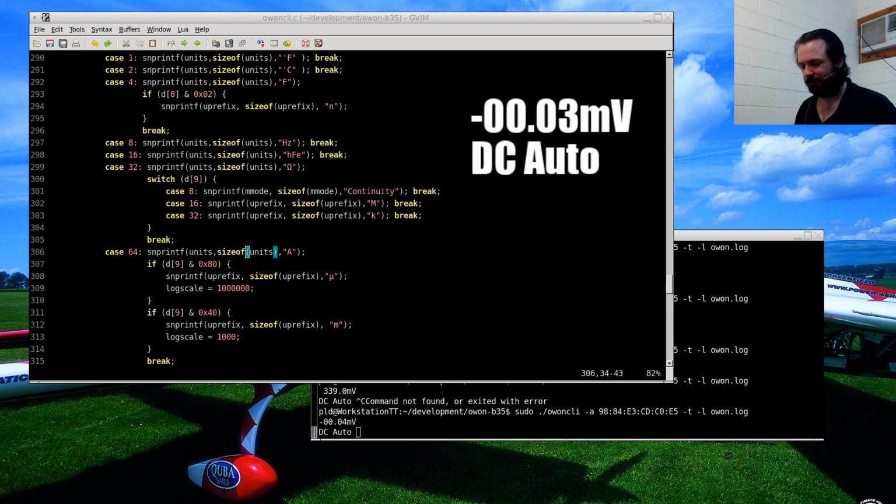Everything's working, but I have some kind of a drain on the phone where roughly every 10 to 12 hours it will drain the battery. Everything seems to work, other than the fact that when you plug in with no battery, you do not get the Apple logo. So there's a common element, I think, between it draining fast and it not coming up with just the lightning port. It's not the TriStar. I've had 4 TriStars on there, and it will charge if the battery is dead flat, to the point where it won't show the insert lightning cable logo or anything like that. When it just stays completely black, it still will boot up and charge once you plug the lightning cable in.